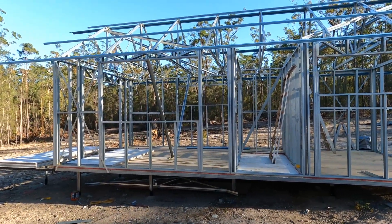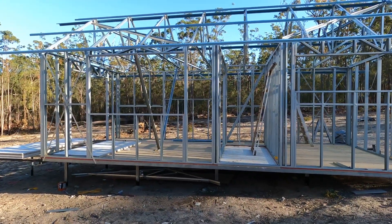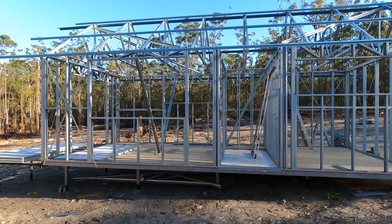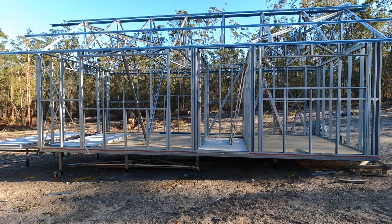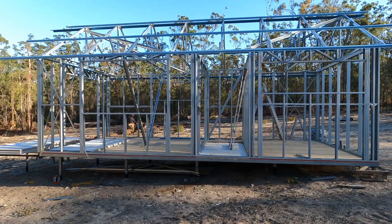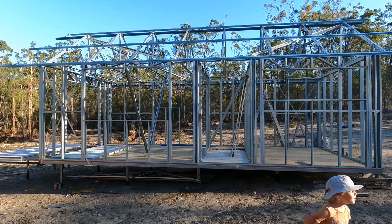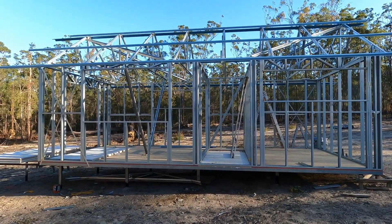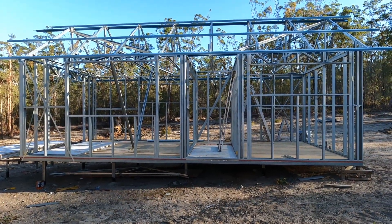It took five days to get to this point — set our profiles, dig the piers and stumps in, build the floor frame, get all the flooring down, build the wall frame, stand them, plumb them, build the roof trusses, put the trusses on, put the battens on. So anyone can build something like this. It might take them more than five days, but it's doable. If you've got no idea what you're doing it might take you two weeks, but you'll get it done. If you want to live off the grid cheaply, you build something like this and you don't have a massive overhead.